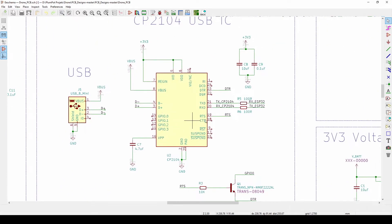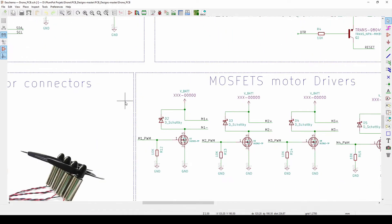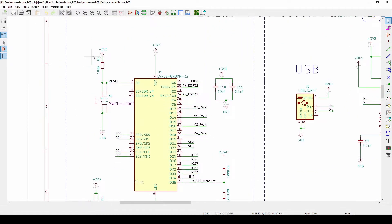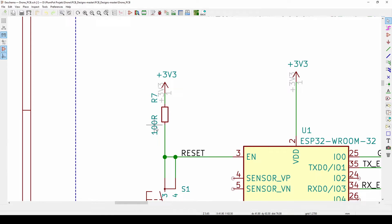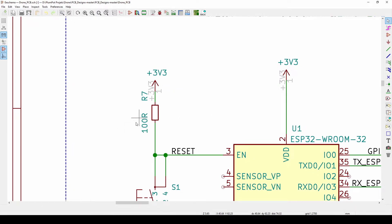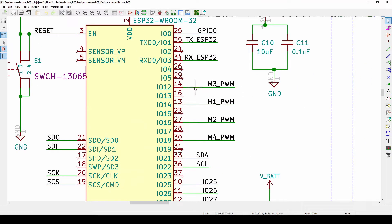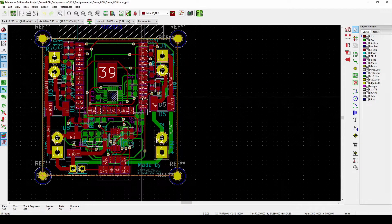Going through the circuit, as you design more PCBs you always spot small mistakes. This 100 Ω pull-up resistor is quite low — never make a pull-up resistor that low. I did fix it because when I get the boards I can populate my own resistors, but it should be at least 10 kΩ. Also, your PWM signals have to be on pins that are PWM-capable — not all ESP32 pins support PWM, so check the datasheet and make sure the pins you use are PWM capable.